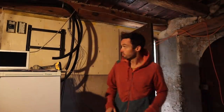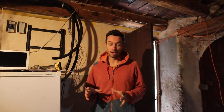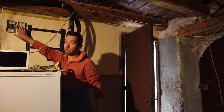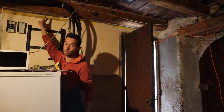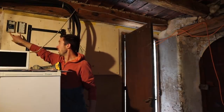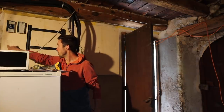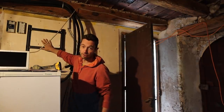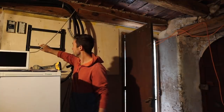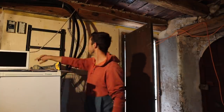So today is a bit of a rainy day outside and I'm gonna do my setup for the solar. At the moment, these are gonna be the two DC isolators. This is where the power comes in, direct current from the solar panels, so you can switch them all off before you do any work here. Then it will come into the bottom of my solar inverter, which will go here. And I'm basically going to put a load of screw holes in this, screwed up rather than use the big bolts.